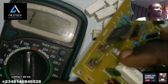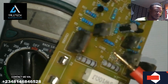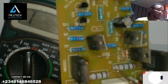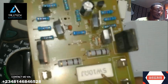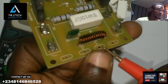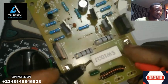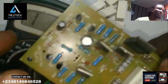If this choke part is faulty alone, there will be no sound output from this board. From my transistor, this is my voltage in and this is my output. The two sides connected together pass through this choke, and from this choke it sends to this inductor and then to the output side. So if this choke blows out, there will be no sound output. Indirectly, if I replace a faulty choke, this board will come back to life.